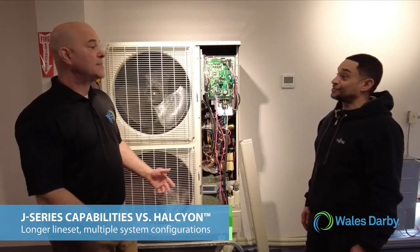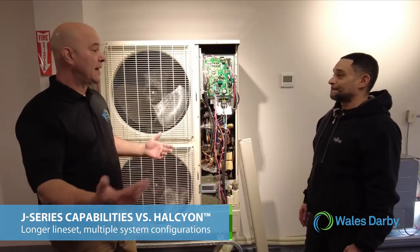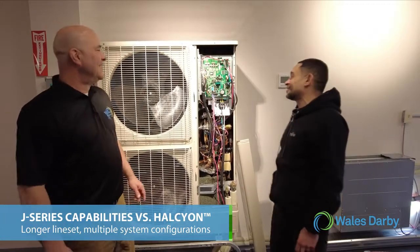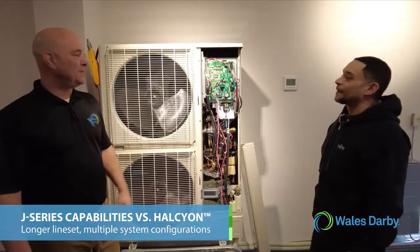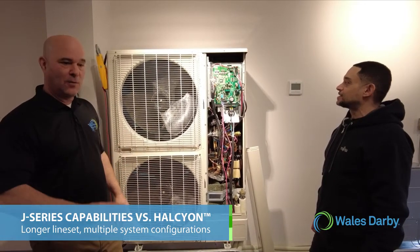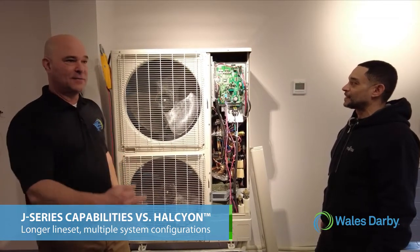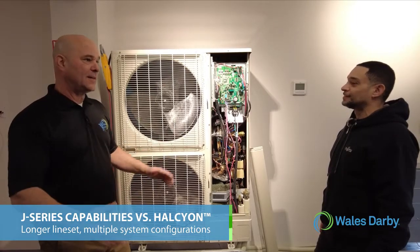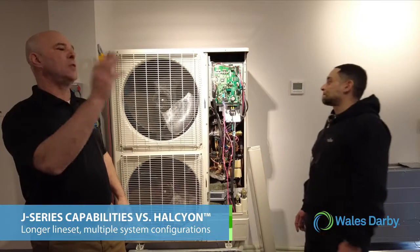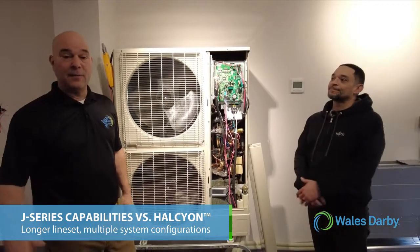Yeah, 1,640 feet on the J-Series compared to Halcyon? You have a big difference. Definitely a big difference. We could get upwards of over 300 feet more with a J-Series, depending on the application. So I don't want to throw numbers out there and have you say, oh, he said it could be that. No, it depends on the installation. But we do give you much longer line set capabilities than with Halcyon.